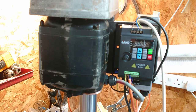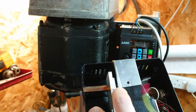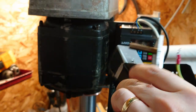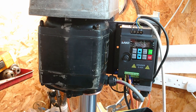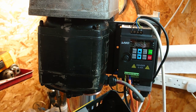At the time, which was probably eight or nine years ago, I looked at the price of VFDs and they were all around £150 plus, so I thought I could do that cheaper. I built my own, which you might have seen briefly on previous videos — it consisted of a microcontroller on a homebrew circuit board and a power stage, a module I bought which had all the power transistors in it. The rest of it was just filtering and all the other necessary bits and bobs to make it go. There was loads of fun with noise making it work, so I ended up putting a screen between the control electronics and the power electronics, which did the job and it worked fairly well for quite a while.